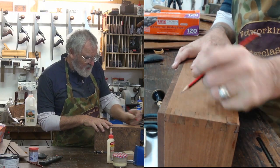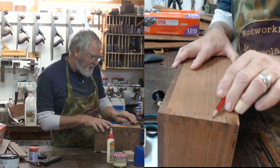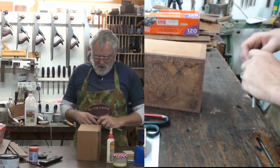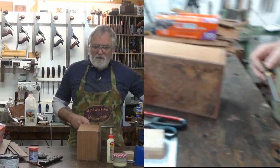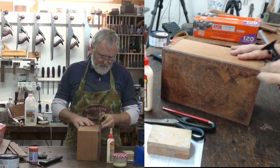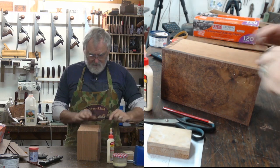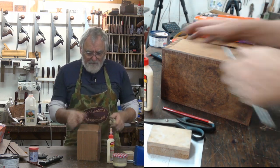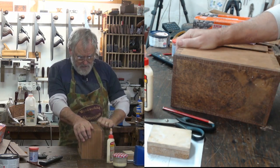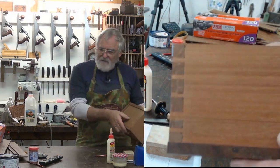there. So I've got little dovetails at the top here. Oh, I know there's big gaps in there. And then there, so we'll cut it off there. Let's get a marking gauge. Set it to whatever that is. It's there. And mark all the way around the box. All right, so we've got that marked all the way around.